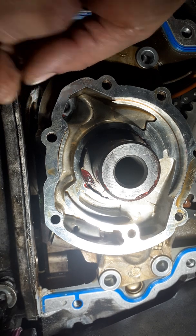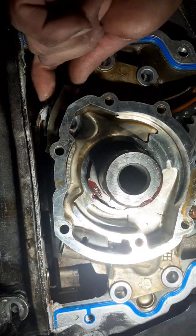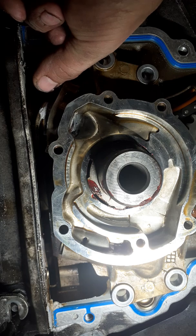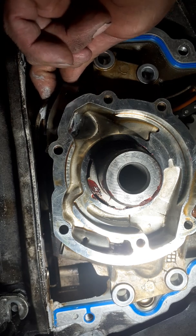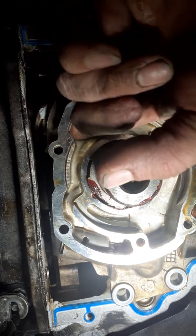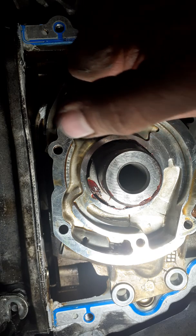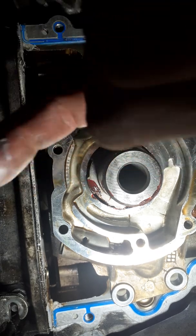To retain this in place, you can use a bolt in here with some washers, just so you're able to push this against it. Tighten that up. Make sure that your O-ring is right with this open — you can actually see how the O-ring is. You have to make sure the O-ring is in the right place, and you can wipe the extra silicone off the hole.